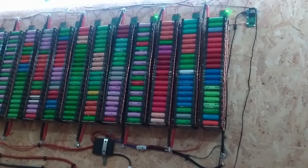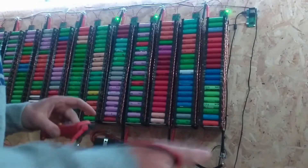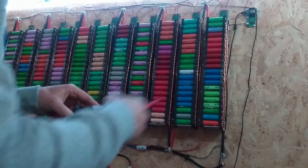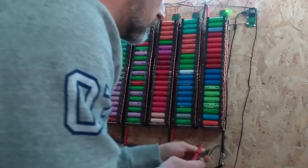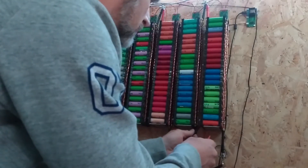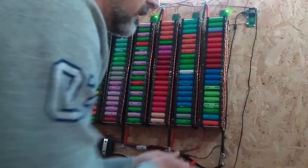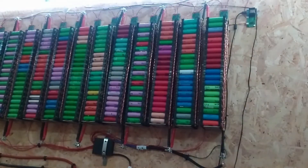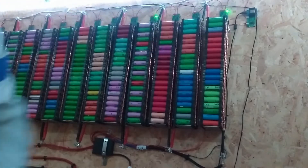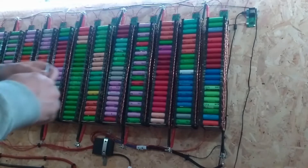My plan is to try and bolster that pack up a bit and see if that makes a difference. Let's just see what voltage we've got. I've already drained a few cells down to 3.9 volts so I can swap them in — this pack needs to be at about 3.9 volts for me to be able to do the swap. So that's at 3.9 volts, so that's good. I'll just disconnect this pack now while I swap these cells over.